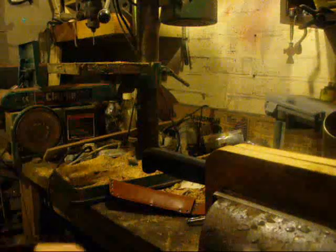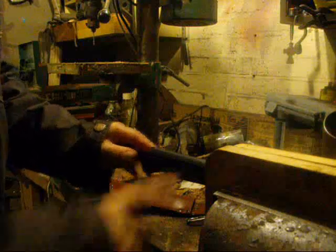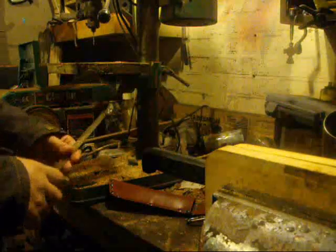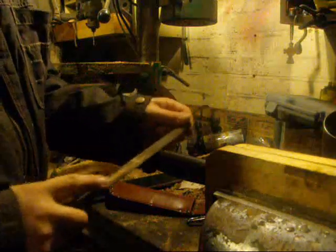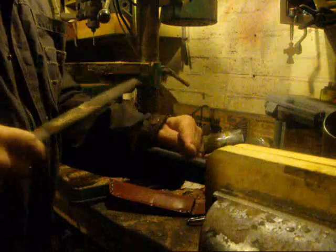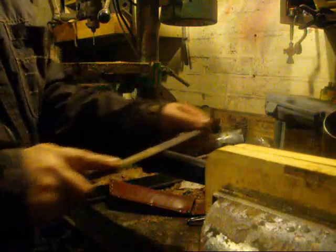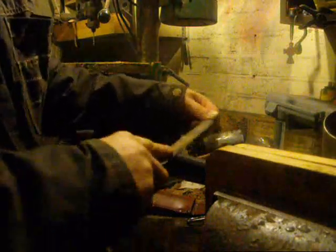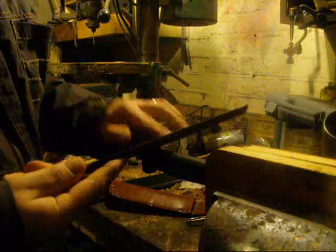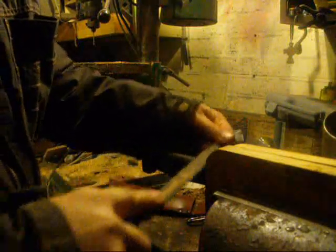Okay, so I've got it clamped in the vise between two lumps of wood, so that's quite solid, and I'm going to work on this with, to begin with, a rasp. Now I find the rasps are very good on your side, but they break out the wood on the far side, so I'm going to gradually just go like that on this side, just until the rasp starts skimming the stock of the metal in the middle there. There, and stop.